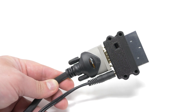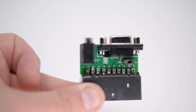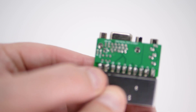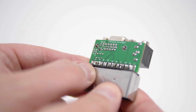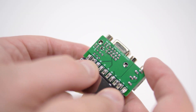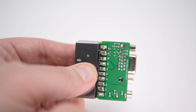Let's start with a quick overview of how it works. This is a device designed by Tienfong that's part connector adapter, part sync combiner. The RGB and ground signals are passed directly through the D-sub connector without any conversion at all. A 3.5mm jack allows audio to be routed, and all of those signals are passed directly to the SCART output, converting the connector from D-sub to SCART. The only circuit in the adapter, and what sets this apart from other connector converters, is the sync combiner and sync attenuation.